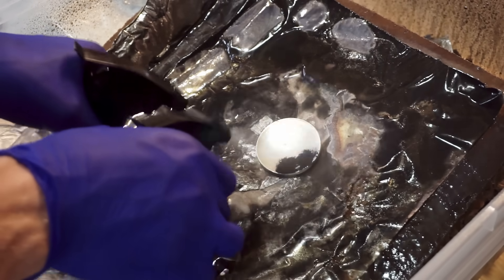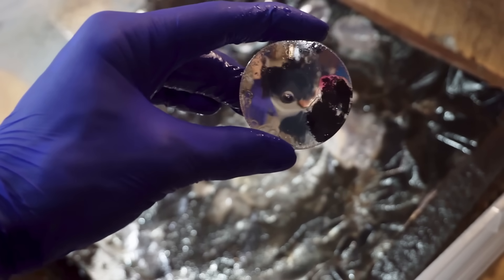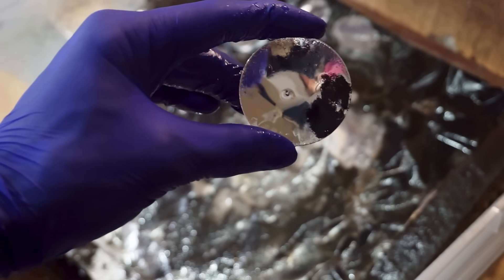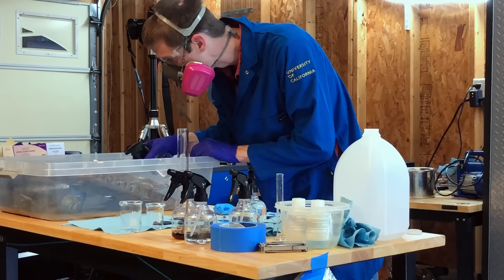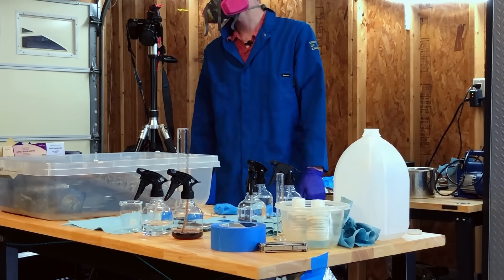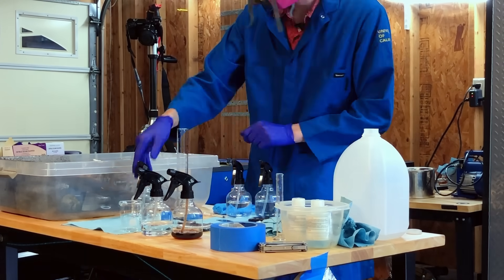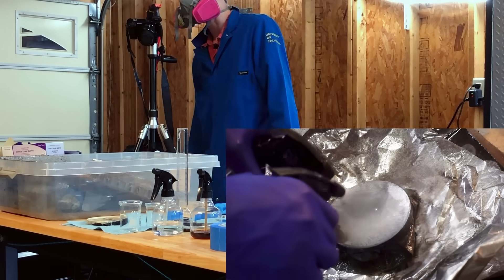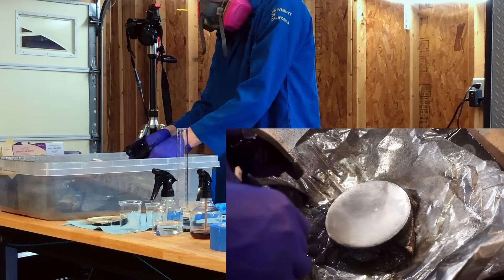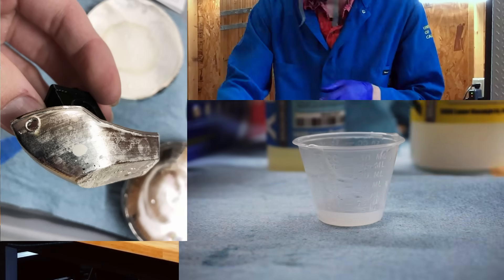So that's the mirror finish I wanted. It worked. Somehow I had managed to mix a batch of resin that reacted with the chemicals during the silvering process and actually roughened to the point where it wouldn't be a mirror anymore. Sometimes it was so bad you could see the roughness even before the silvering agent went on. Something in the hard resin was probably reacting with something in the wetting agent or even the water.